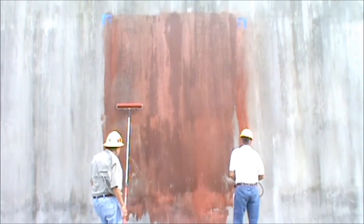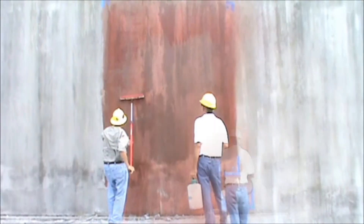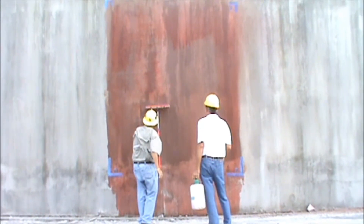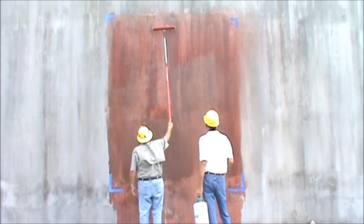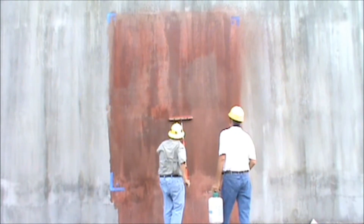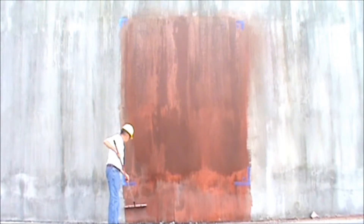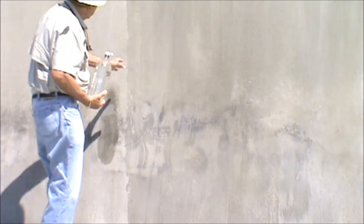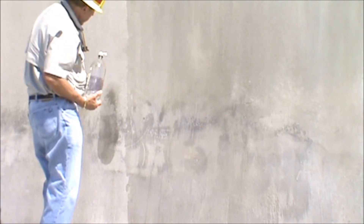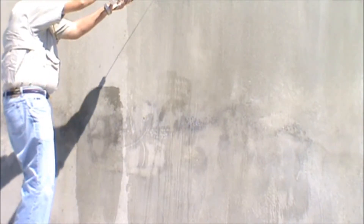Now that the product has been applied, you can see the depth of the red tint. From this we know that it not only has been applied, but it has been allowed to penetrate into the shotcrete material. The next thing we'll want to do is come back to this tank and test the surface for water absorption — very easy to do. We can see one of the reference dots in the lower left-hand corner, and note that the other dots are still available for reference, even though the red tint was washed away in the first rain.